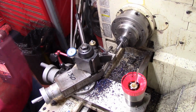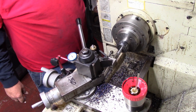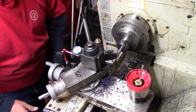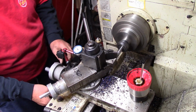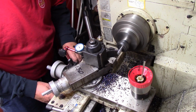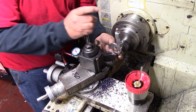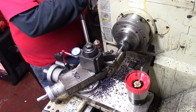All right, what I've done is put this in a collet. This other end here that I'm machining on is 207 thousandths diameter, or 210 to 207, and it has to be about 3/4 of an inch, plus or minus about 5 thou. So we're going to go ahead and start the process of whittling this end down. Just take me a cut for a measurement. And so basically I got about 200 thousandths. So I'm at 405, and so yeah, I've got a good ways to go.